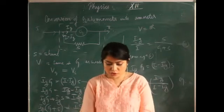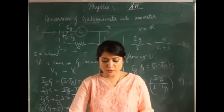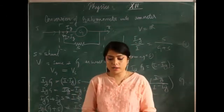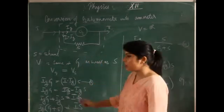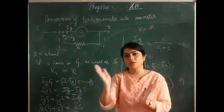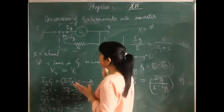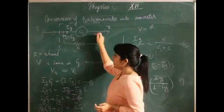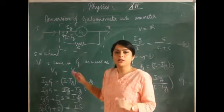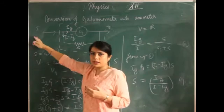Now, a few things you need to remember from this part. An ammeter is not like a galvanometer. It gives a specific range of measurement. If it is for an ammeter, then it will show the current in the range of the ammeter. If it is in milliamperes, then we need a different device, a milliammeter, to detect the current. Suppose Ig gives a full deflection in the ammeter, from 0 up to, say, 3. When we have an ammeter, we actually don't know what the current division is: the amount of current flowing through G and the current flowing through S. What we know is that I is the current giving the deflection. But actually Ig is giving the deflection, not I.